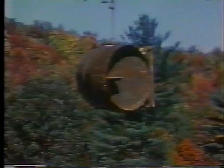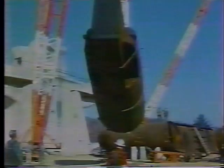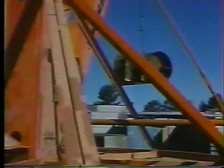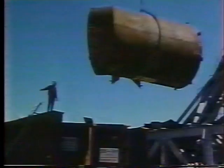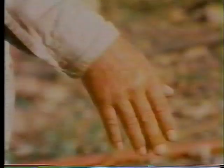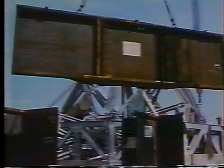The yoke is an all-welded A201 steel structure involving many plates up to 6 inches in thickness. Completed, the assembled yoke itself weighs nearly 600 tons; in addition, the cylindrical bottom half will hold 700 tons of heavy-density concrete for rough balance, plus about 35 tons of cast iron trimming blocks for fine balance about the polar axis. All pieces were welded into the largest sub-assemblies the derricks could lift. Constant checking, controlled welding sequences, preheating, careful welding supervision, and 100% radiographic inspection were applied.